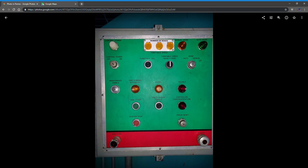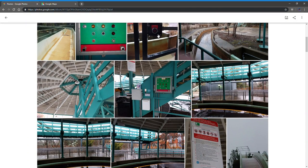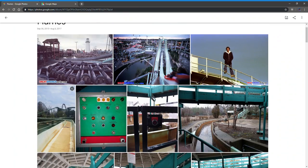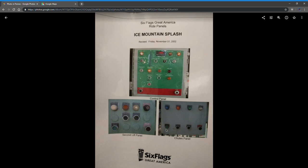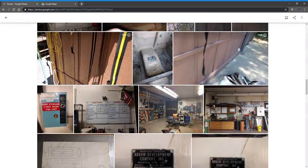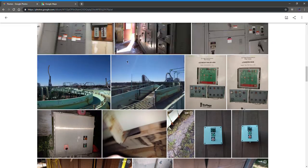Once the pumps are going, maintenance starts up the ride and you test all the ride stops: the turntable stop, the ride stop, the chutes stop, and the two stops at the top. You start and stop it about three times when turning it on in the morning. I think that's pretty much it — every time I make one of these videos I think of more things after I upload it, so I'll probably have to do a follow-up on this ride. See you in the next one.